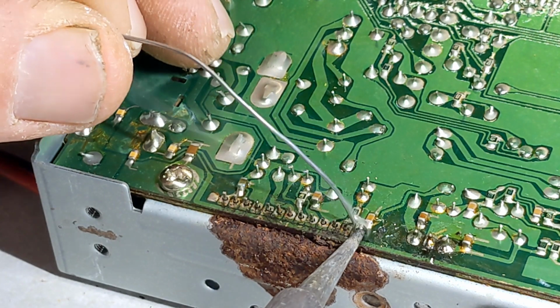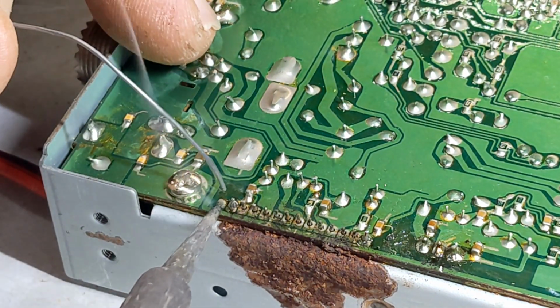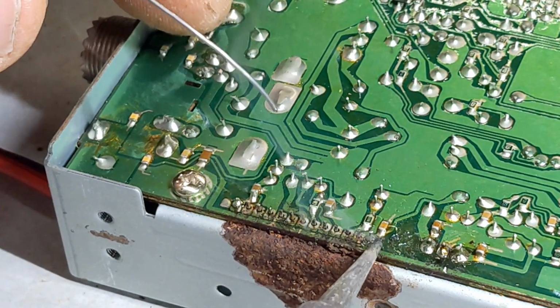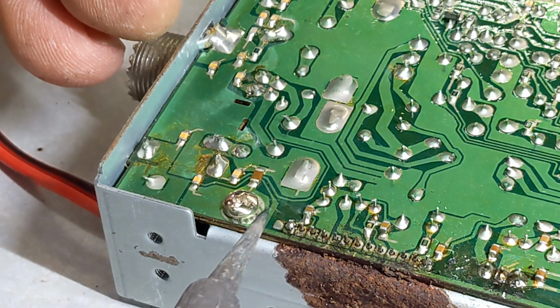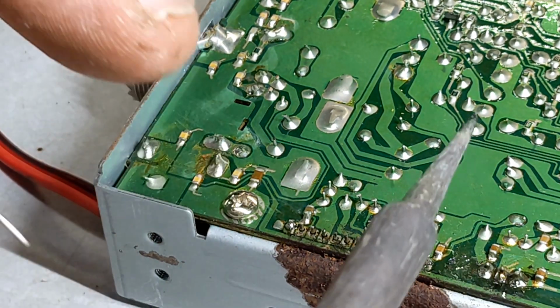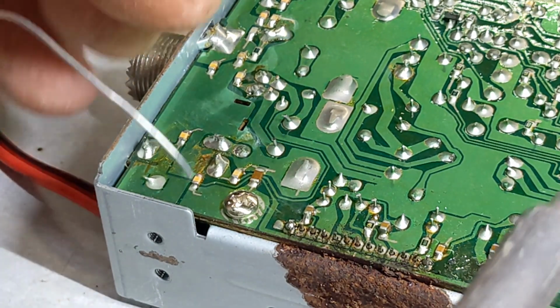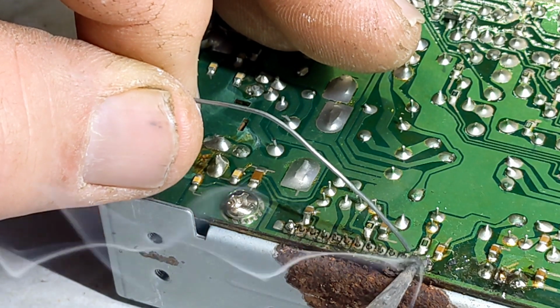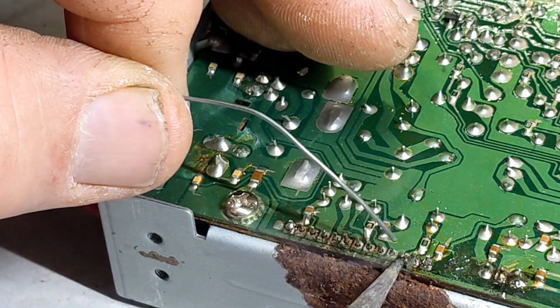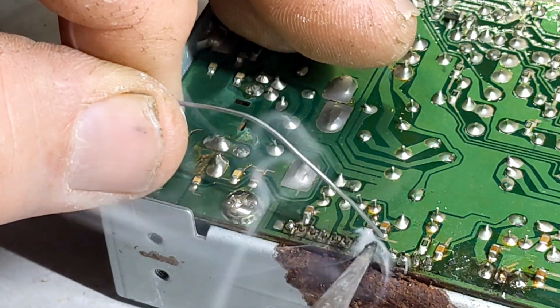And we'll start here. I'll start at this end. So you want to do it either end. Like if you are soldering this in, me personally, I like to solder this end and then that end. It keeps it even, because if you start soldering this way, it could lean to one side and not do it evenly. This way it holds it on both ends. But, you know, you don't have to crisscross like you do lug nuts on a car.